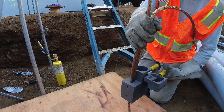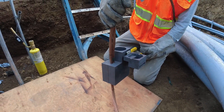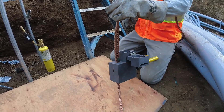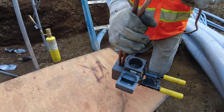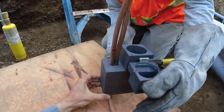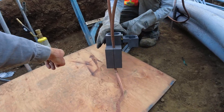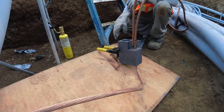Okay, so now we need to get it to balance itself vertically without being held. Should we use this wire? Which way does it want to fall? Okay, I would maybe bend the bottom wire more — but don't do it in the mold because you're just flexing on the graphite mold. See how the mold's opened up? Rotate them a little bit more, bring the handle around on that side. See all the graphite falling out — you really got to watch that, never flex on it like that.